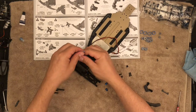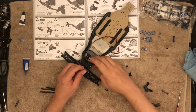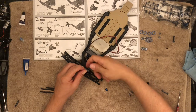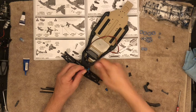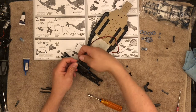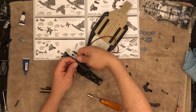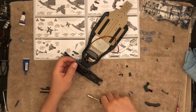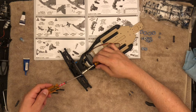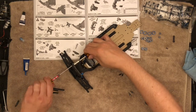Once you do that, you will need these — they actually thread on, but I'm going to put a little bit of thread lock compound right in here. Both of these will just thread on. These actually use a seven millimeter driver — so if you just have a seven millimeter nut driver or a seven millimeter wrench, you can go ahead and use that. Barely fits. Once you have your electronics you're going to be out of luck though. Snug is all you need.